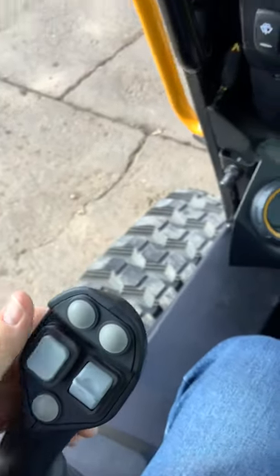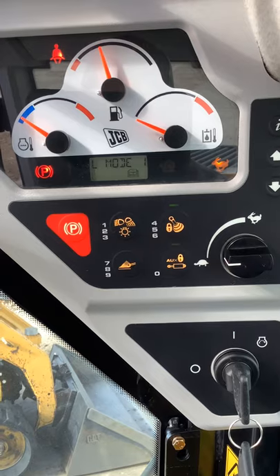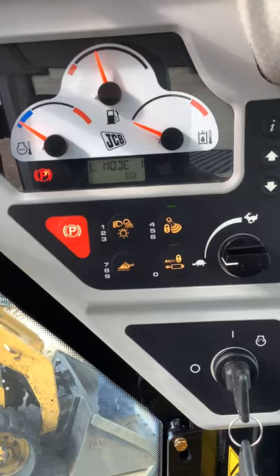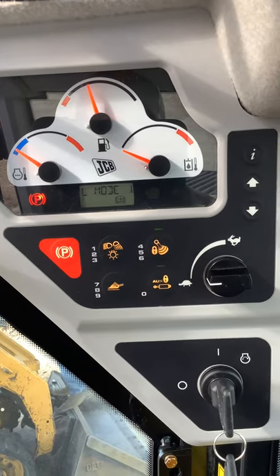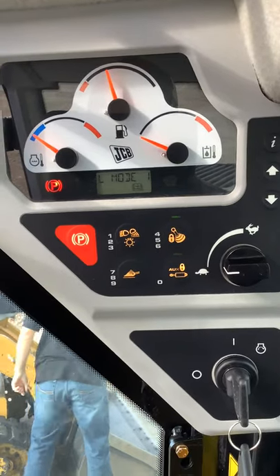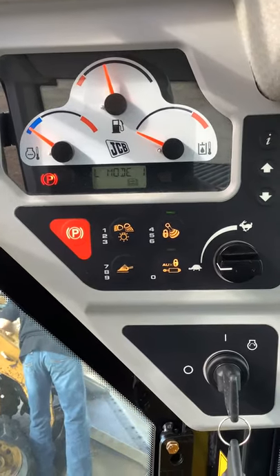Going back to the joystick and the buttons underneath — I'm going to hit the rear one, which is going to be for your two speed. If I hit it once, you'll see that the rabbit light is going to come on, and now I'm in high gear. If I hit it again, that light goes out and we're basically in turtle at this point, or low gear. Anytime you're pushing something heavy, you're going to have more torque in turtle than in rabbit. If you're running across a distance on a lot or at your ranch, then obviously rabbit's good because you can transport the machine faster.